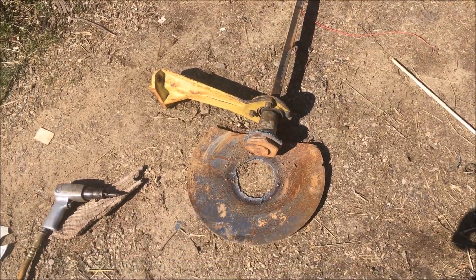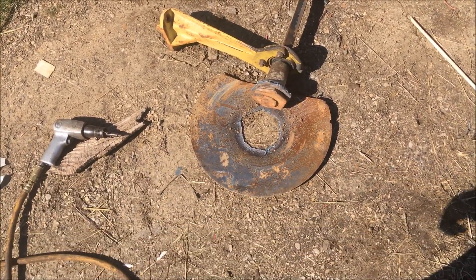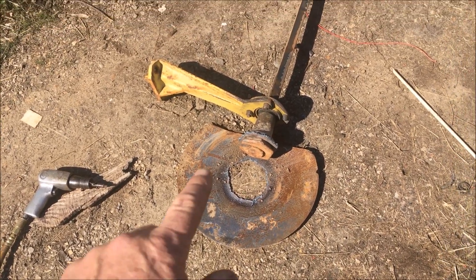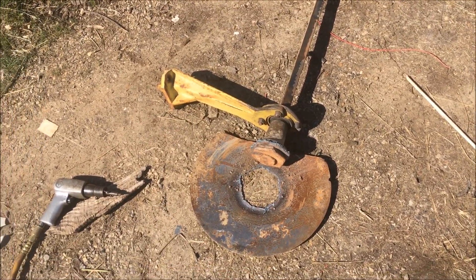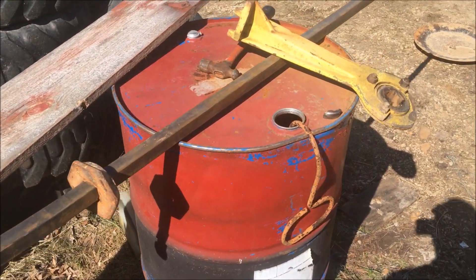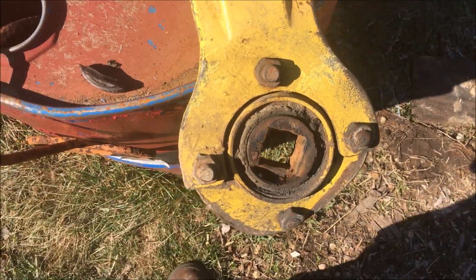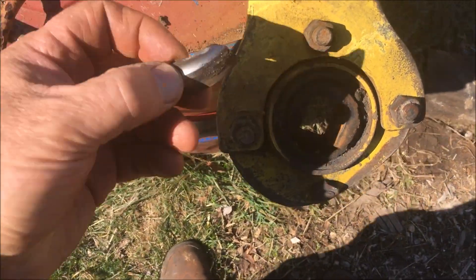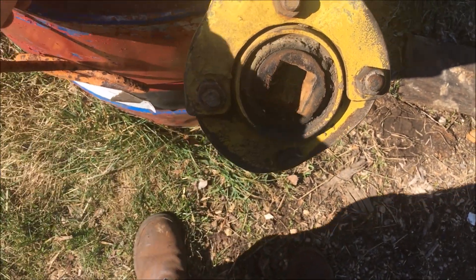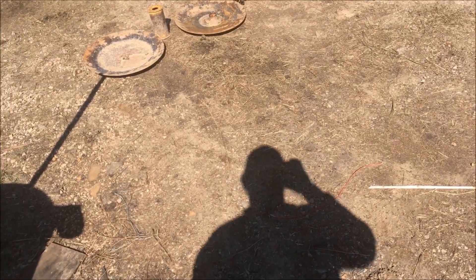This bearing is being a little stubborn about sliding off the shaft. Because this disc was bad anyway, I went ahead and whacked it off with the torch so I can get a better swing at it with a hammer. Well, the good news is I have this gang all apart. The bad news is I have a broken bearing — this looks like an old break; I don't think I did it today. Anyway, this gang can't go back together today.